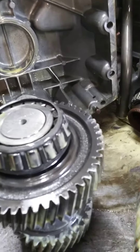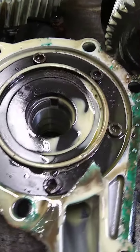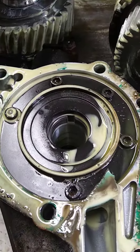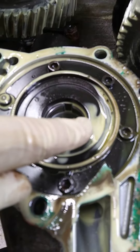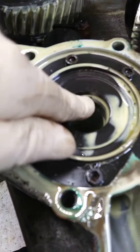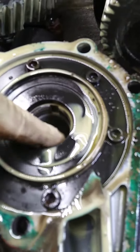Hey, this is Chris from Hail Marine. Here's the pump of a 63 IV — when you add motor oil and water, you get this kind of gunky looking thing. What it does is it tears up the gears on the inside of this thing. I can't even get the gears to budge on this little bugger.